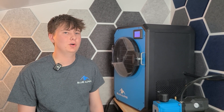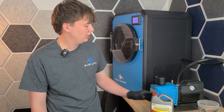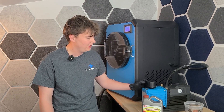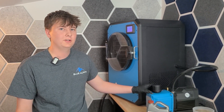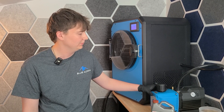Hey guys, my name is Tegan and in this video I'm going to show you how to run evapo-rust through your vacuum pump. Evapo-rust will help get the grime and all the build-up off of your casting and your pump head. It's good to run at least probably once a year. If you do a lot of sugars and things like that, it's better to run it more often because it'll have more build-up on your vacuum pump.